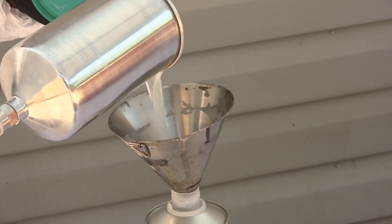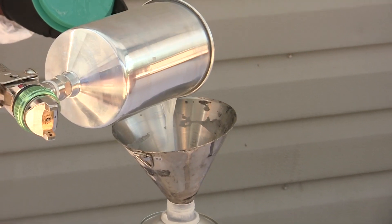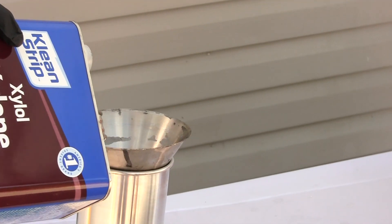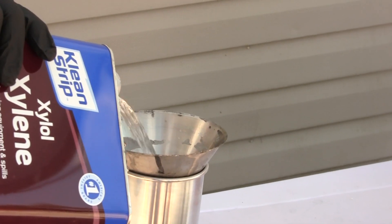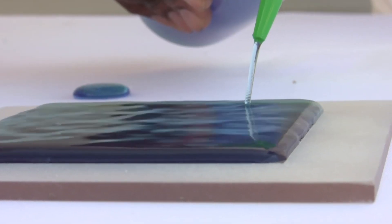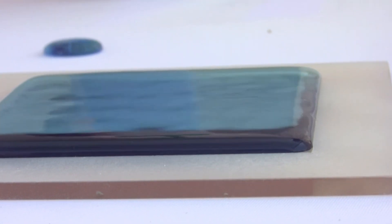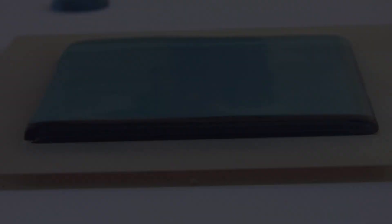The perimeter of this glass has been coated with Ultra EverDry. Note the coating is hazy, not clear. Any remaining top coat in the spray container can be carefully poured back into the original container for future use. Clean up the sprayer using acetone or another organic solvent as soon as possible after completing the spraying of the top coat. The top coat is responsible for the super hydrophobicity, oleophobicity, and self-cleaning properties of the Ultra EverDry coating.